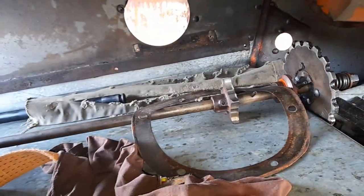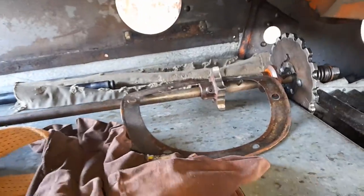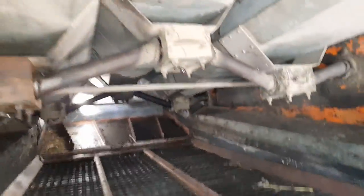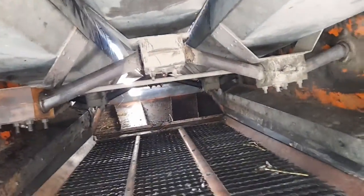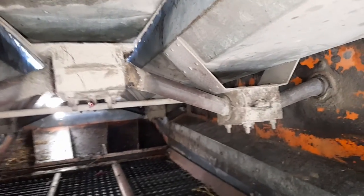I've took this shaft out here, which is what drives the internal elevator. The elevator is behind — there it is, it's actually sat in there. Because these sprockets are very worn and I wanted to change them — there's that canvas in the background, I'm going to get another one of them made. And the walker bearings — I've done this one here, better than it was but it's not perfect. The others are very loose and worn, so I'm going to sandpaper the edges away. Or I could get some made, but I think I'll probably just persevere with the ones I've got for the minute, because of the amount of money I'm going to have to spend.